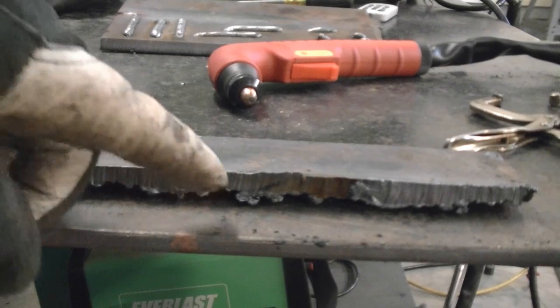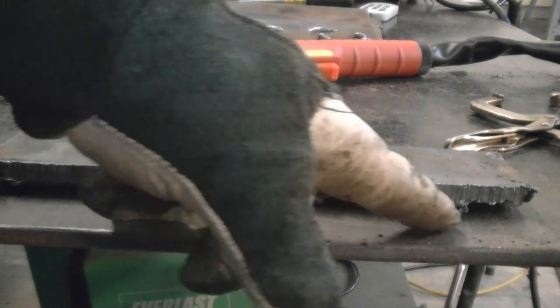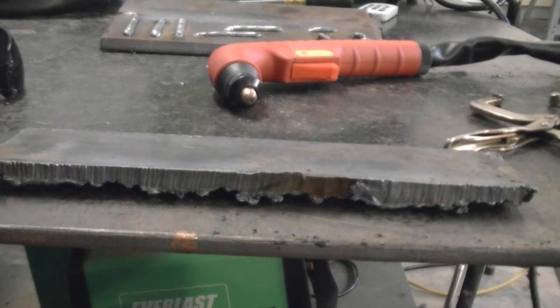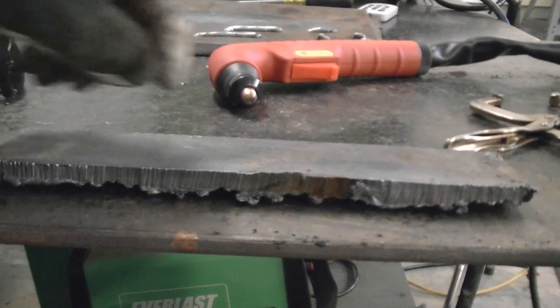There is a little slag here, but a lot of that is due to the presence of carbon that was trapped in these bad welds that the students had done. What we've got here is a weld that's at the thinnest 3/8" and at the max about maybe 5/8" of an inch. This was all done with 40 amps and about 55 pounds of air pressure.